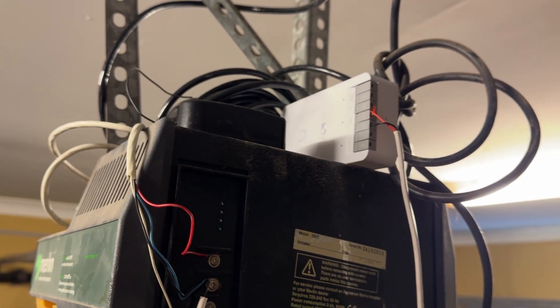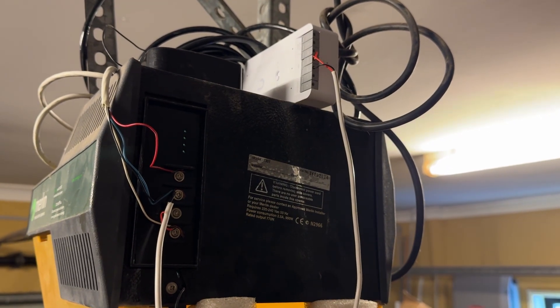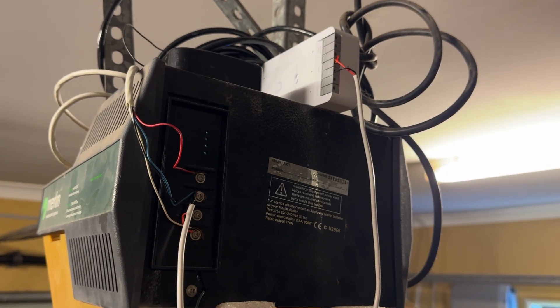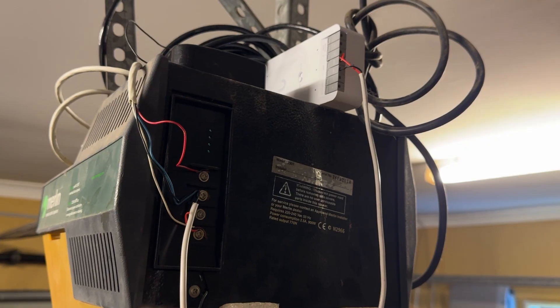You can change how long the circuit is open for — maybe you want to drop that to one second, because if you hit the open button and realize the car's still there you want to be able to hit the button again to stop the door moving. So let's quickly jump on the phone and I'll show you this in action.